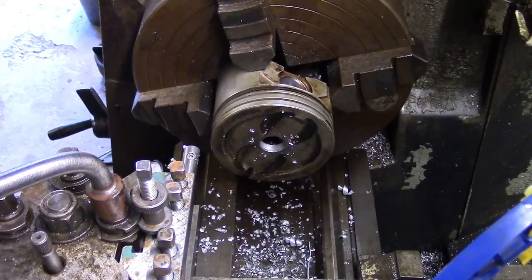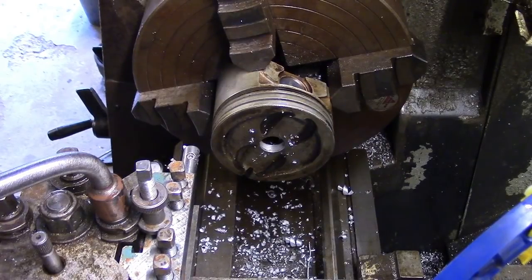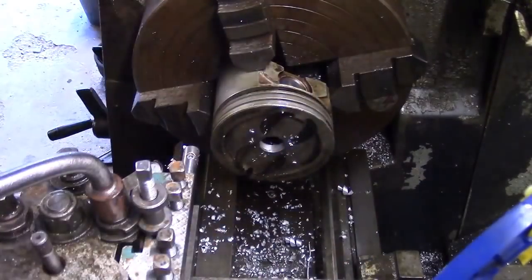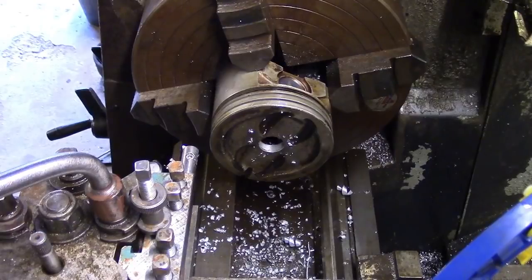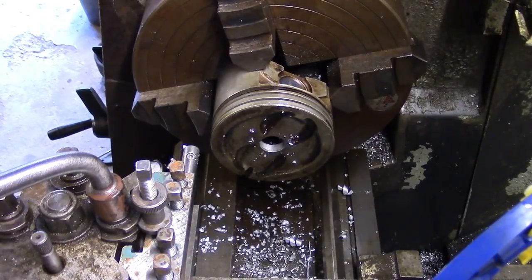However, turns out on the bottom of the gear train, at the back of the headstock there, there is another one. Because when I was putting pressure on the threading handle on the carriage here, because of the way the lead screw works, it nips both sides of the lead screw, you know, the half nut, that was actually stopping it from turning because the pin on the other end was broke. So I think it was an 11mm pin by 3mm diameter. I made another one, and Bob's your uncle, everything works all right.